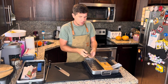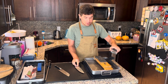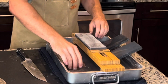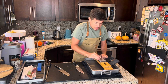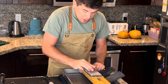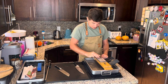One. All right, so that's 1,000 grit. Now I'm gonna move my way down even finer to 5,000 grit, all right? Now this is very important. This one right here, you wanna stay nice and steady and you don't wanna put a lot of pressure to it whatsoever. And you're gonna see how fine this really pulls material off. And you wanna make sure it's clean, that there's no marks on the stone whatsoever, because that creates imperfection in the honing.